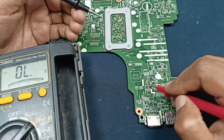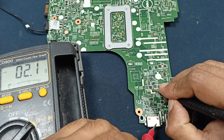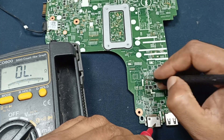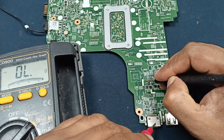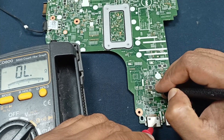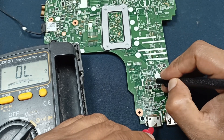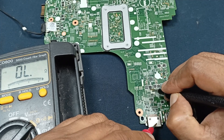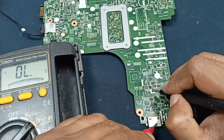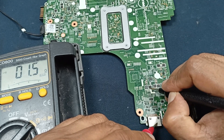Okay, this MOSFET — let's check this and this pin is also shorted here. You can see the capacitor short is not present. This line short is disconnected and due to the MOSFET this line is swing short. This one is ground, this one is the positive voltage, this one is the 3.3V output, and this line is still short with the ground. We need to find out which component is making the circuit short.